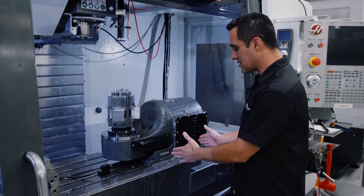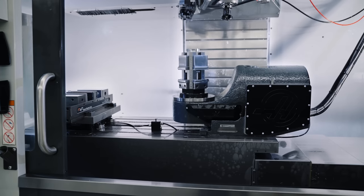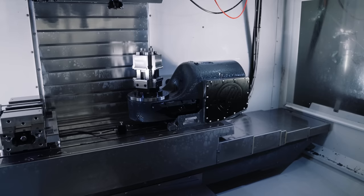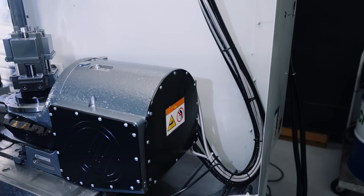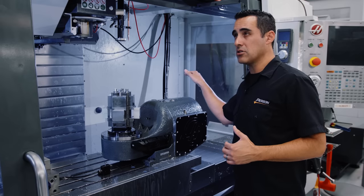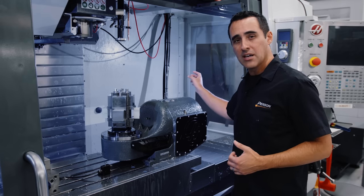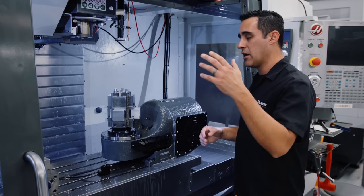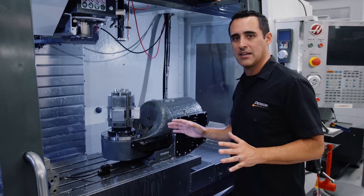The next thing is bolting this all the way off the edge of travel, which makes me a little nervous. We bolted it all the way to the right-hand side of the table to maximize the left-hand side, and when the table is jogged back into the back right corner, things get really tight. So we actually limited the travel of this unit — it's short about an inch and a half both in X and Y — because I don't want to pinch cables or have anything caught back there. That's user travel limits, easily done in the Haas control.